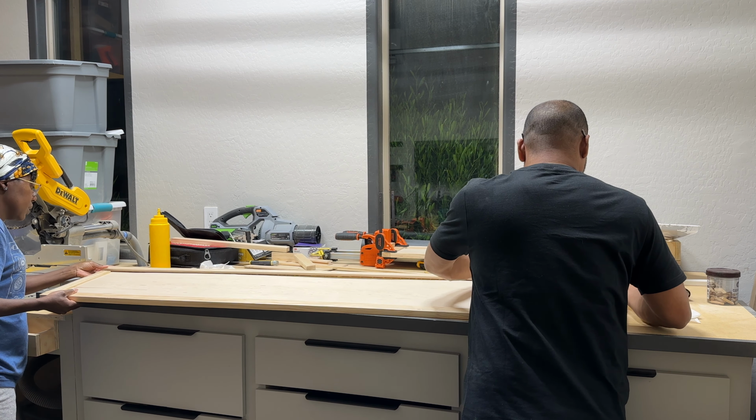We also used a concealed hinge jig to create the holes for the cabinet hinges. Since I wanted inset doors, we went with soft closing, 110 degree hinges. There was some back and forth on the hinge adjustments until Bernard was able to get the doors closed completely and accurately. Finishing details to this project included installing the shoe bench drawer fronts, the cabinet hardware, the coat hooks, and art.